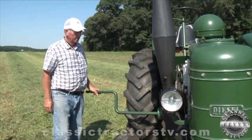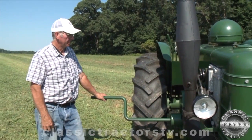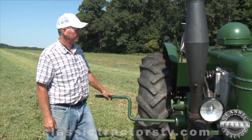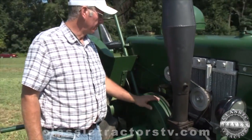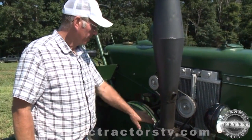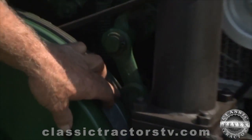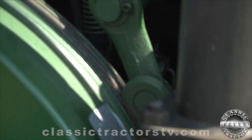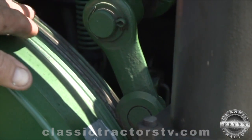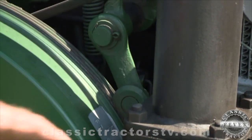All right, now we're going to demonstrate how to start it with the crank start method. My son's going to be cranking it here. One thing that we've done different, it doesn't matter about lining up the arrows, but we have put the compression release in the fourth groove out. These grooves are cut on a spiral just like a thread. And what happens is as this is cranking over, it works its way over to the end. It'll give Ben 4 revolutions with the compression released.